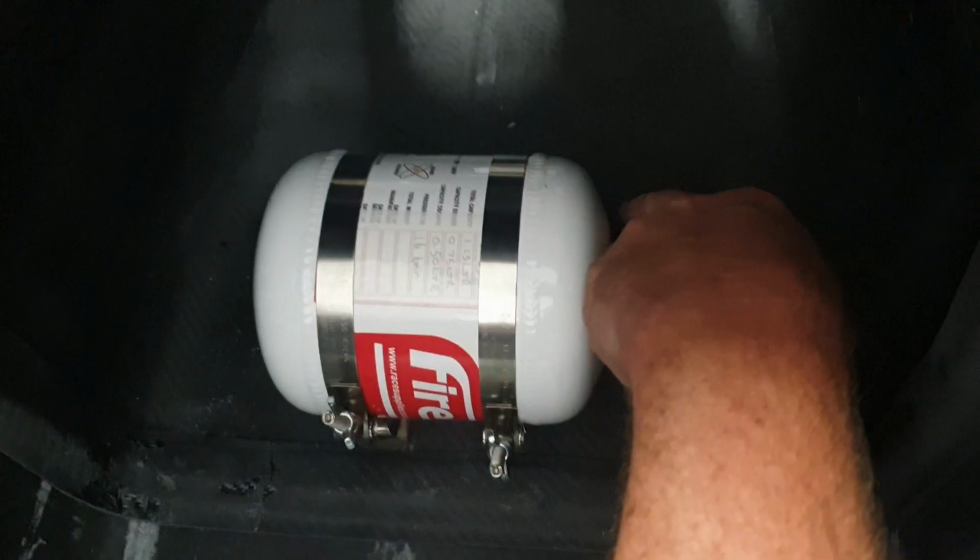The hose will then come out here, come up along the edge here, along the rollover bar, and then here's where the steering column's going to come out and go down in between the steering channel to the steering rack, which will pretty much be dead straight from here. So there will be a nozzle around here facing downwards onto his legs at that angle, and there'll be another nozzle facing this way, towards his chest area. It'll spray this way and the other one will spray that way.